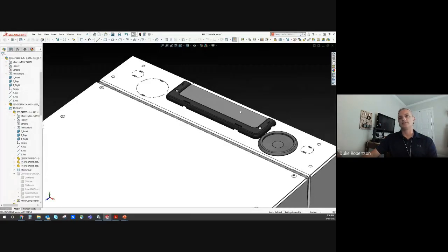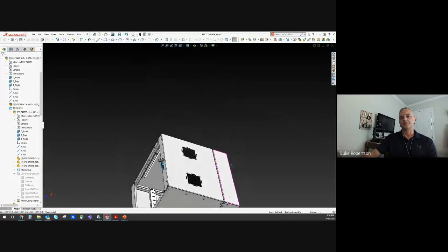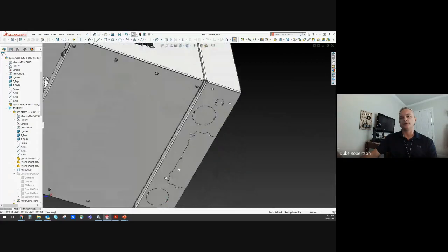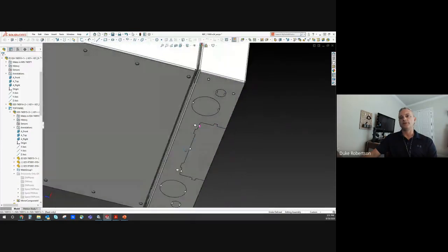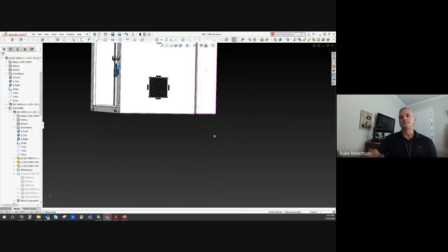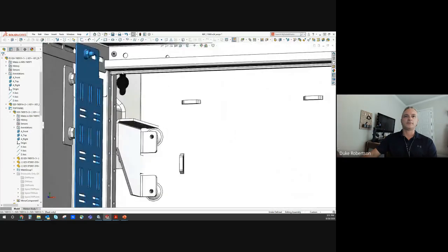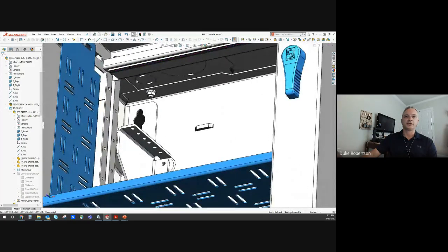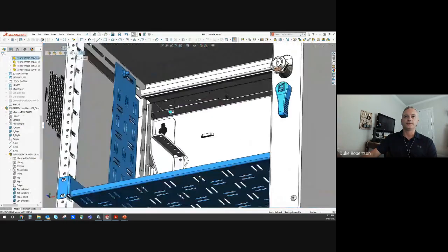Then here in the middle, I'll flip it on the bottom side since it doesn't have the brush installed. But here in the middle is more of a rectangular knockout. So if you do need to retrofit this around some cabling, you'll remove this centerpiece here. Then the top and bottom portions of this rear section come apart. You can see the hardware here to remove it.